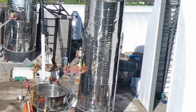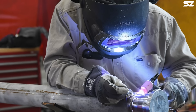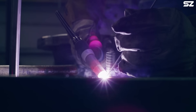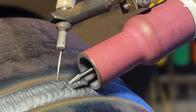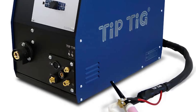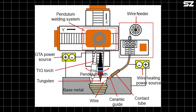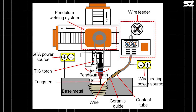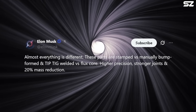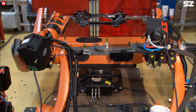After that, SpaceX made a major switch with Mark II, adopting the Tip-Tig welding method. Tip-Tig is a variation of gas tungsten arc welding (GTAW) that adds filler wire agitation to improve the dynamics of the molten weld pool, making it more fluid, helping release gases, reducing the risk of inclusions and porosity, and separating impurities. It introduces a vibratory motion to the wire and applies hot wire current to the filler metal before it enters the weld pool. This resulted in thinner welds with less warping. Elon Musk confirmed that switching from flux-core to Tip-Tig improved accuracy, created stronger welds, and reduced overall weight by up to 20%.